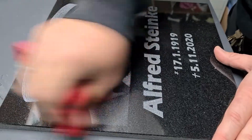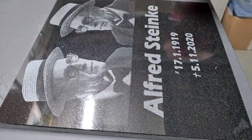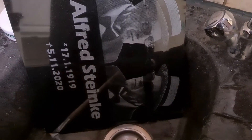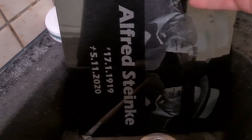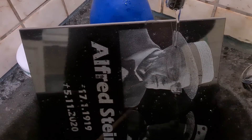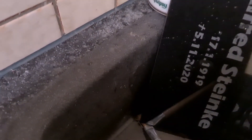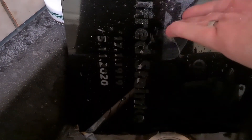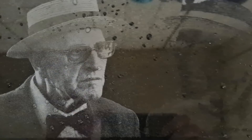The image is protected, coming off really clear and bright. Even if it's wet outside, you will still see it. If you wet the stone, the protected areas are still visible — very sharp. The wet areas you don't see, but the sandblasted image is clearly visible, much better than a lasered image. Even the deeply sandblasted areas show clearly. That's the effect, and that's the reason why we cover up — to get a clear image with really nice detail.